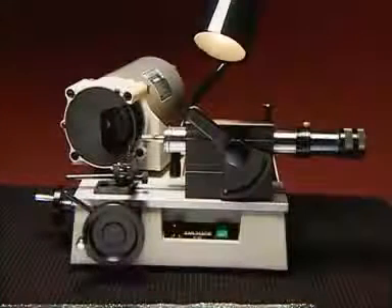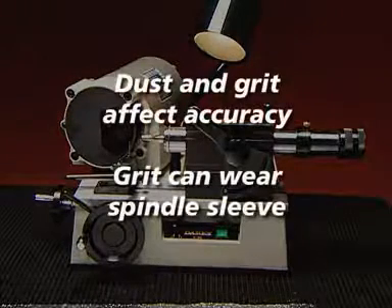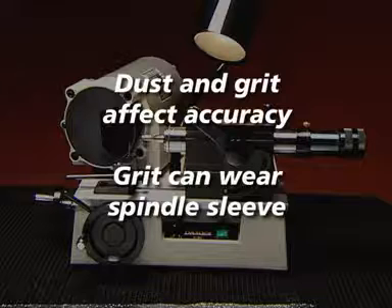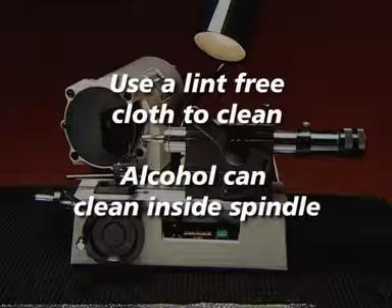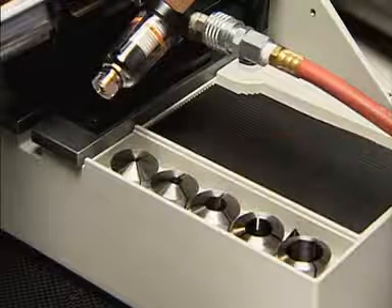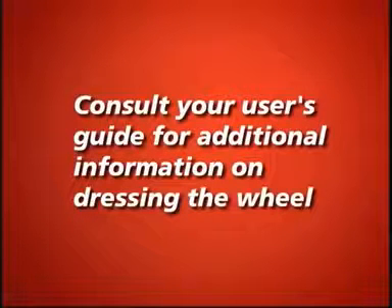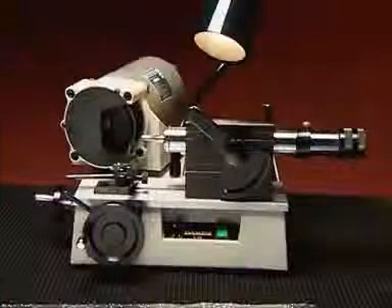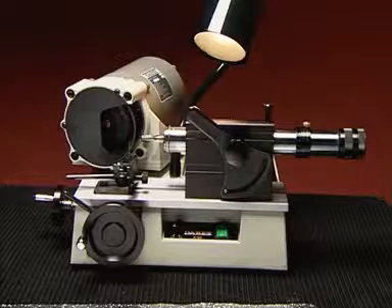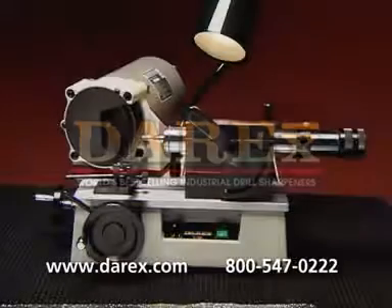Your Derex is a precision tool and should be cleaned regularly to remove dust and grit. Accumulated dust and grit affect the accuracy and effectiveness of your sharpened endmills, and grit can wear and plug the air spindle sleeve. When you clean, use a lint-free cloth to clean the outside of the air spindle. Alcohol can be used to clean the inside of the air spindle. Cleaning the collets with compressed air will ensure the collets are centered in the air spindle. In addition to dust and grit, you will need to periodically dress your grinding wheel. See your manual for more information.